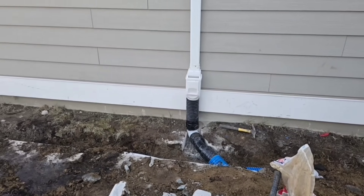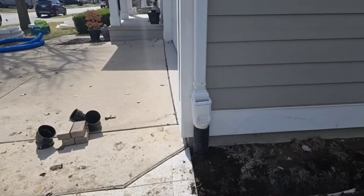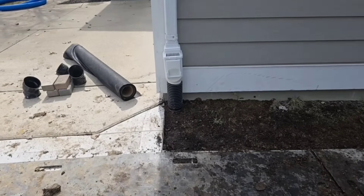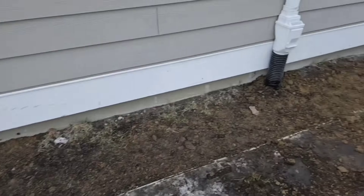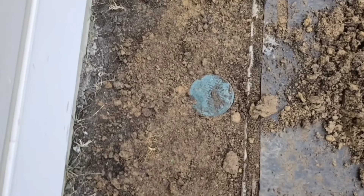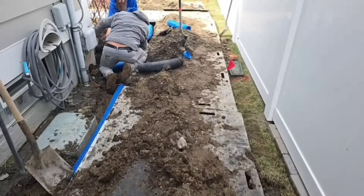Those white leaf filters on this house — they're killing it. That's sharp. When you have a concrete footing on one side and a cement walk on another, there's no need for a turf restrictor plate, nor is there room for one. The guys did a real nice job on that.